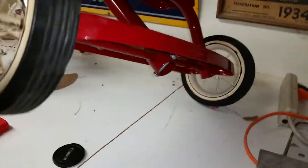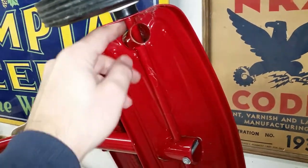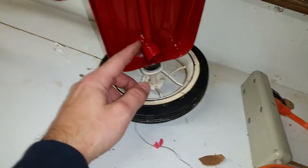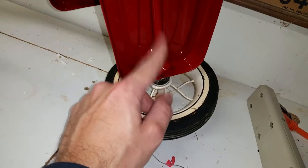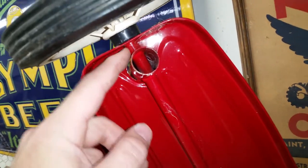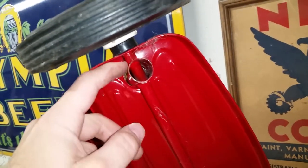What I'm going to have to do is remove that axle. I also noticed these down tubes coming out here that I didn't notice beforehand, so I'm going to cut them off on both sides. The only weld below this weld is holding on the little footplate — there's nothing else structurally holding it together. Since the axle tube is coming out, I'm hoping to use these same holes and fit my new motors in and mount them directly underneath.